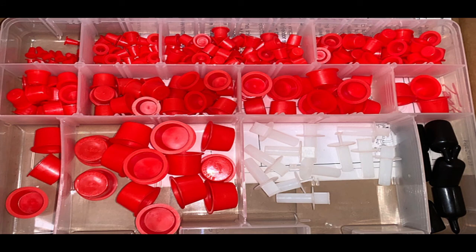Last, we're going to talk about clean care — simply keeping dirt out of the common rail fuel system. All lines you take off need to be capped. Any open holes need to be capped unless you have a test tool screwed in. Remember, we're filtering fuel at 4 microns — Google how big 4 microns is and you'll understand why. If the guy in the bay next to you is buffing a gasket, and your fuel system isn't capped, enough dirt can enter the fittings to take out an injector. It's critical that you cap all open ports when you open this fuel system.